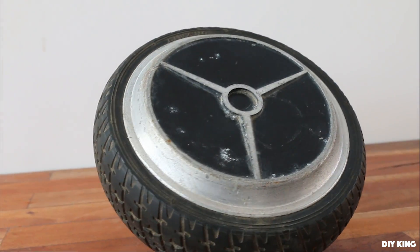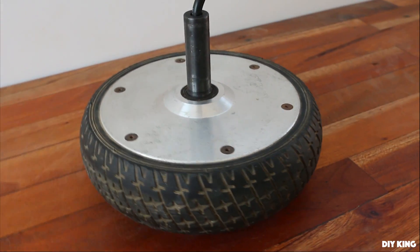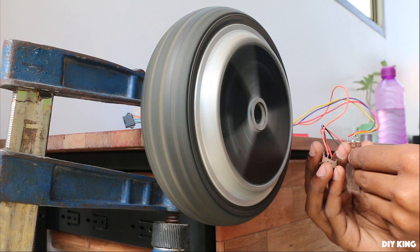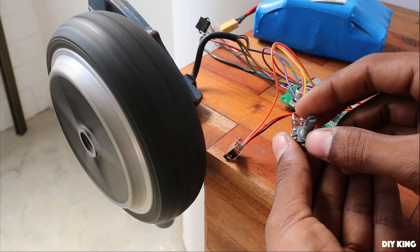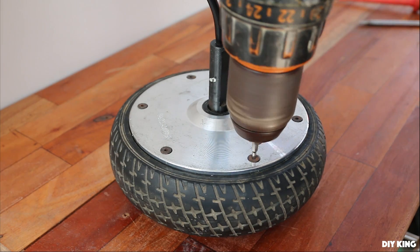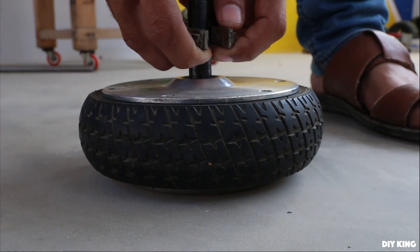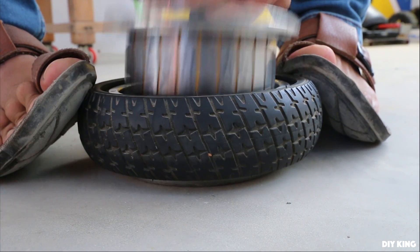For this conversion, we are going to use a brushless outrunner motor from an old hoverboard. It's dirt cheap and it's got lots of torque, which hopefully will help us to drive the chuck directly without the need of an additional gearing mechanism. The first thing we need to do is to modify the motor so that we can attach it directly to the main drive shaft behind the drill chuck.